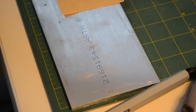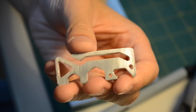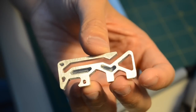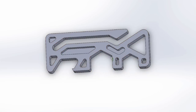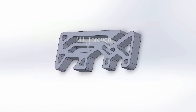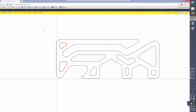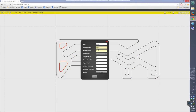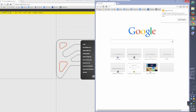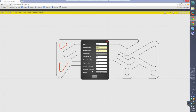Once I was able to play around with this prototype and understand the mechanical properties of my stock material, I decided to go back into my model and be more aggressive with my material removal. I dropped my minimum thickness requirements down to 0.06 inches and added more pockets. All of the features were cut completely through the frame this time. I also decided to drop it into MakerCam as an SVG and take full control of the toolpath generation, since MeshCAM wasn't the most efficient. I wanted my CNC to focus on machining one pocket at a time instead of removing one layer from each pocket every pass, which incurs a large amount of useless travel time.